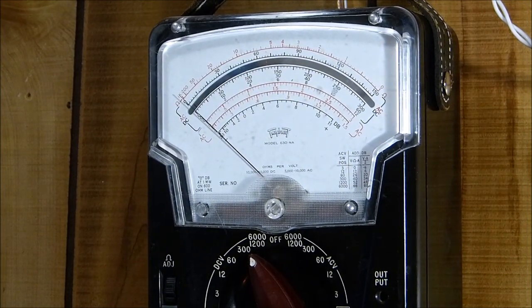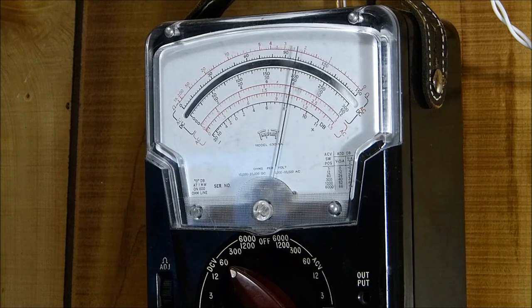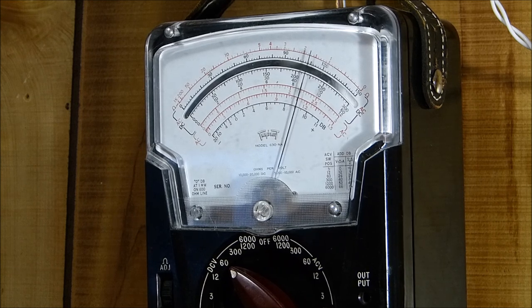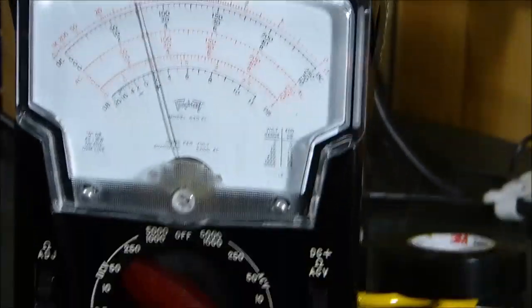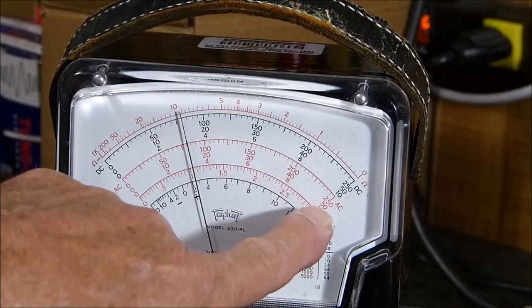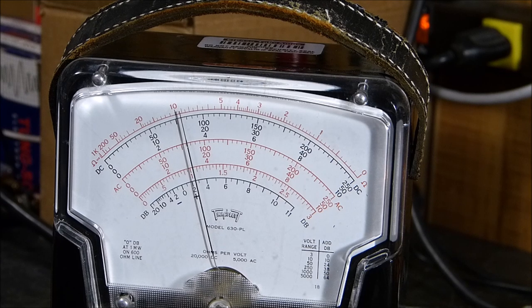At 44 volts on the 60-volt scale, the voltage is cranked up — there's 40, there's 44 volts — and looking down at the current meter on the 1-amp scale, it reads about 320 milliamps. It stays there steady as a rock. That's supposed to indicate the tube isn't a complete dud — a cheap and dirty way to check your 4-400, 3-500, 3-400, etc.